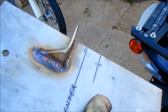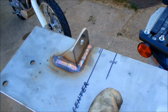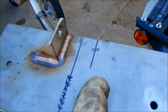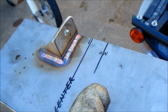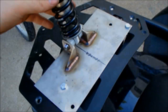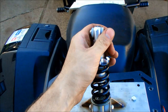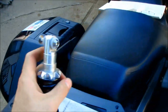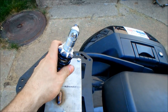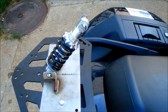I've got one of the shock mounts on the plate. I'm going to bolt the shock in place, tack weld the other one on, remove the shock, and then weld it the rest of the way — that's so I don't burn up the plastic UHMW stuff the bushings are made out of. There's the other one, and there it is with the shock attached. Eventually this is going to go to an arm on a pivot with a pad, and when you lean back it will compress the shock, so when the bike bounces it won't be so hard on the passenger and they won't get flung forward into me.